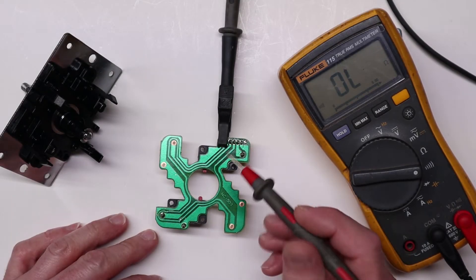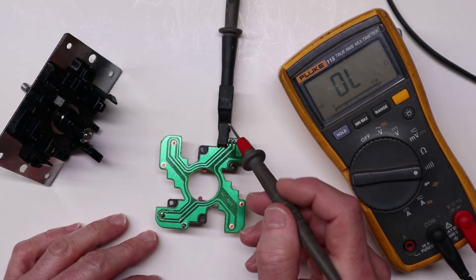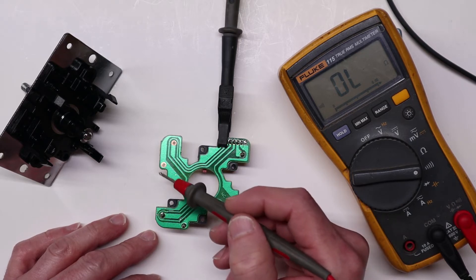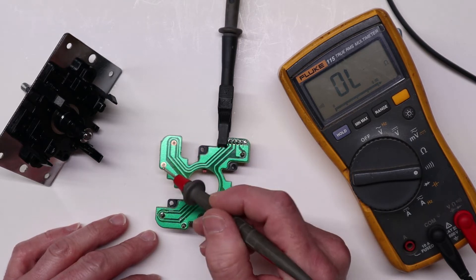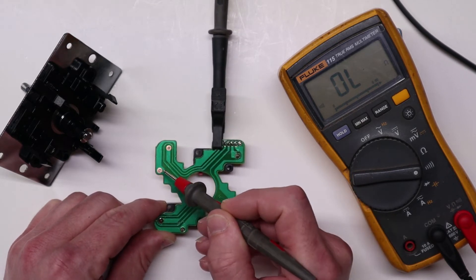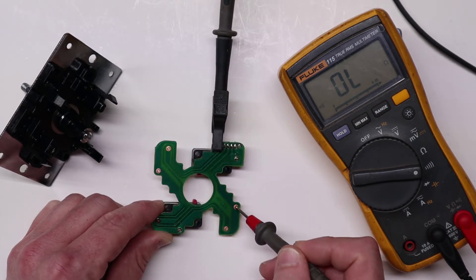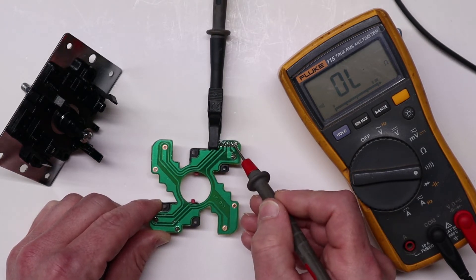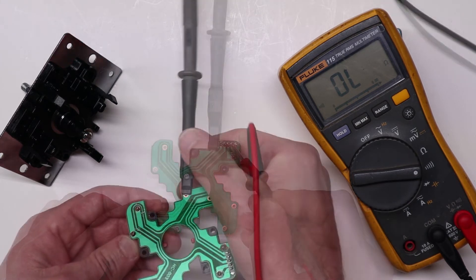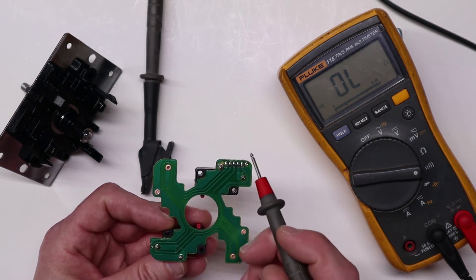So we have the meter attached to this common leg of the micro switch. In order to check continuity, all we should have to do is go to the next pad on the trace, which would pick up the next common leg of the next micro switch. From this leg to this leg — we don't get anything. From there to here — we don't get anything. Nothing. And then back to the pin which would go to the main PCB with the five-pin connector — we don't get anything. So definitely a broken trace. It's visible — you can see it's not connected at all.